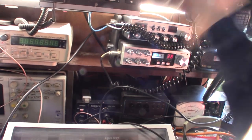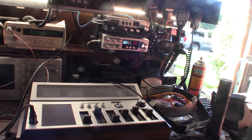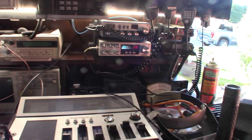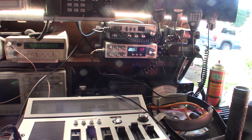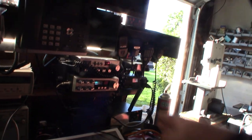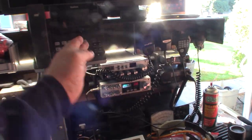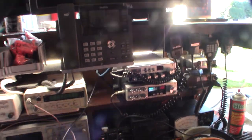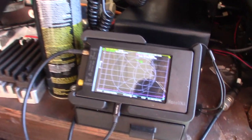So when I tuned it originally, here in my driveway, or on the lawn up the front, I tuned it for a horizontal dipole. So I was actually on the roof adjusting the rod lengths. And no matter what I did, it wouldn't really change. So I'm going to go back up. I'm also going to test this horizontally, to see if it makes any difference. But to test it horizontally, all I have to do is turn it this way, because it's on that mast going that way. I'm just going to turn it. So, yeah, like I was saying, the receive is incredible, but take a look at the nano VNA here.